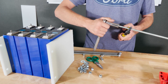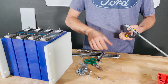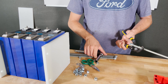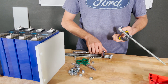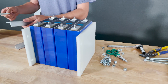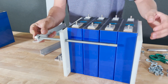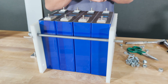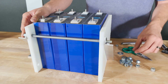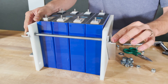I'm using nylock nuts, so I need to grip the rod with a wrench to get them started. I should have deburred the cut ends, but I've got the nut flush enough. I slip on a washer, pass the rod through one of the angle iron pieces, through the hole in the plastic end plate, then through the other angle iron piece, and finish with a washer and another nylock nut. I'll repeat this process on all four rods.